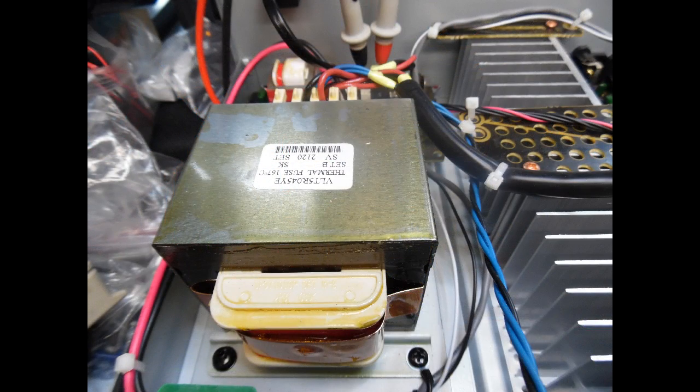The winding was open circuit, which tells me that the internal thermal protection fuse has failed. It's 2023 now and this amplifier hasn't been in service very long, which is a little concerning. More concerning is the cost — while the amplifier retails in the UK for around £350, the transformer comes to quite an eye-watering £94.20 including tax and shipping. I've spoken about this before — I never quite understand why manufacturers price spare parts so high. Simply replacing the main power transformer brings the amplifier back to operational.